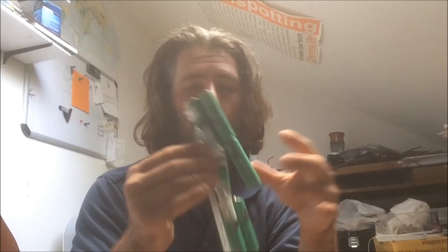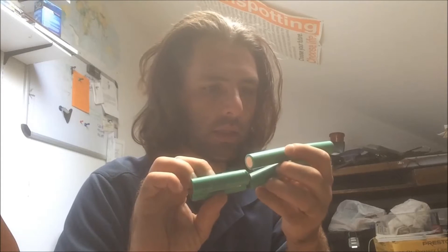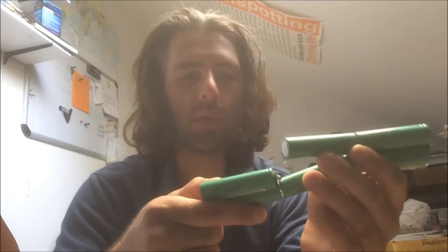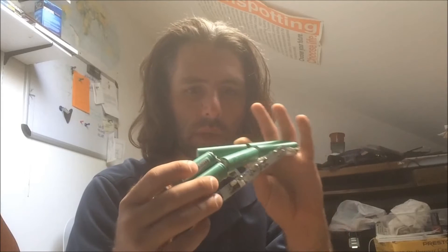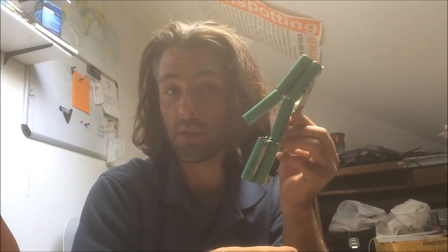Once you have them on the end there, just rip out the guts. Now this is likely a fully charged battery pack. Most of the time what goes wrong are these charge controlling boards. It doesn't look like any heat damage to the cells. No swelling. Looks like the spot weld on this cell wasn't very good, so it came loose over time, probably with the pack being tossed about, and that's it. So I'm guessing all of these cells are good.